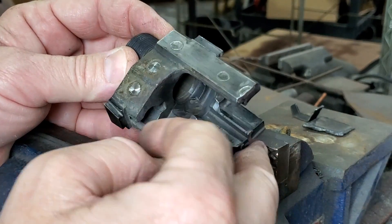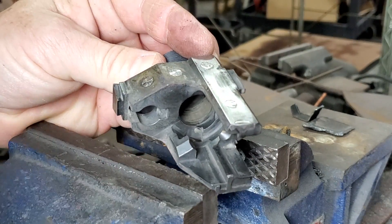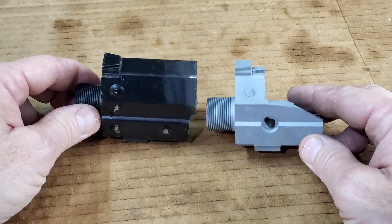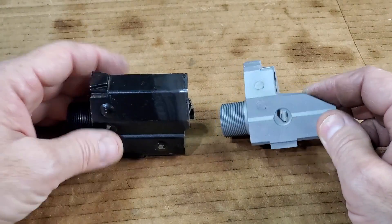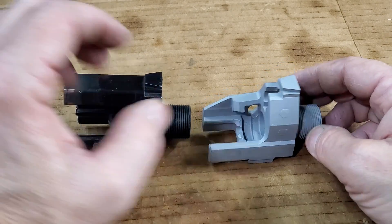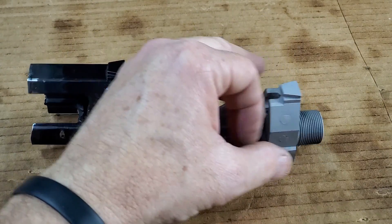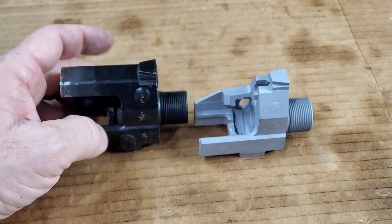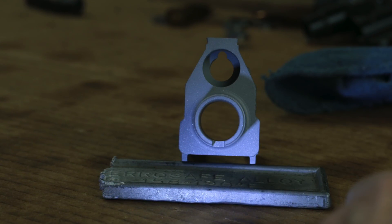Took some time — I probably spent almost an hour on that. I can't wait to look through that hole while cycling the gun, that's going to be cool. Here's a nice before and after shot. Looks like they drilled six millimeter holes through the sheet metal to do the plug welding. This thing cleans up very nicely — sandblasted it, obviously. It's very hard; I'd like to get it Rockwell tested. It's definitely really up there on the Rockwell scale. Well, that's it — thanks for watching. I hope you got some good information out of this, something that'll help you with your trunnion harvesting.